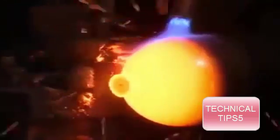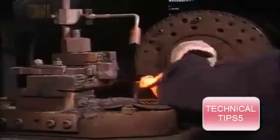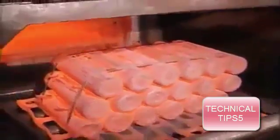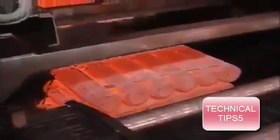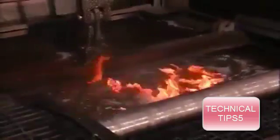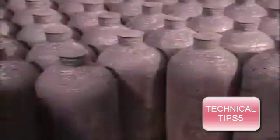The only exit for gases will be through a valve at the top. Workers then place 18 cylinders in a furnace heated to 900 degrees Celsius. After 90 minutes, the machine dumps them in a chemical bath to cool for 6 minutes. The cylinders are then reheated to 650 degrees Celsius for 90 minutes, then left to cool for 2 hours. These transitions between hot and cold — a process called tempering — strengthen the metal and make it somewhat flexible.